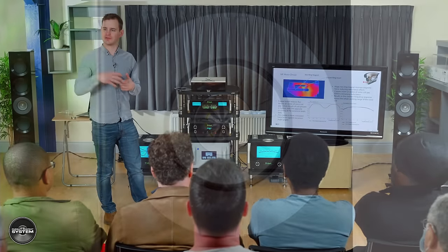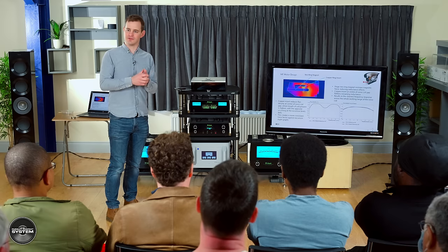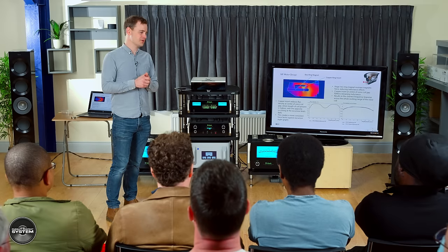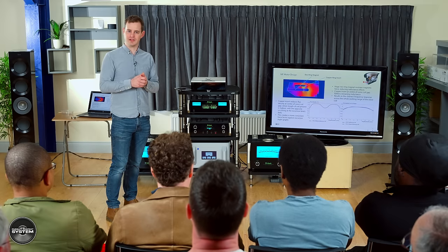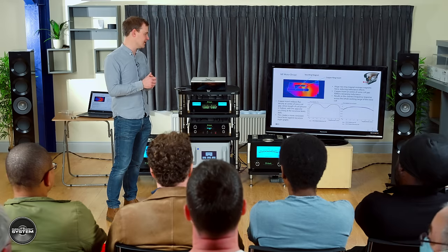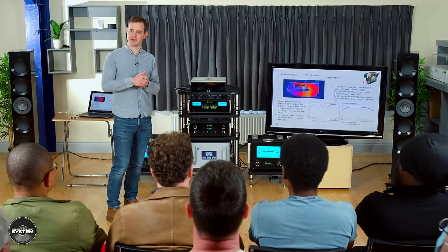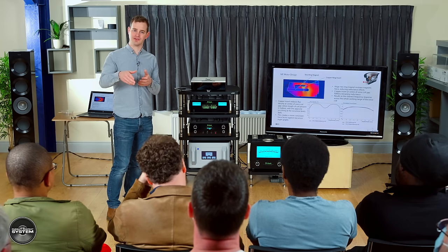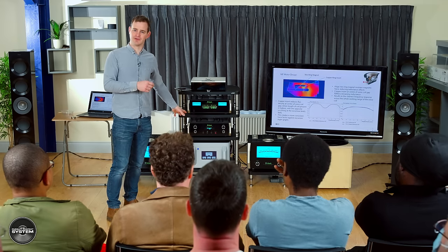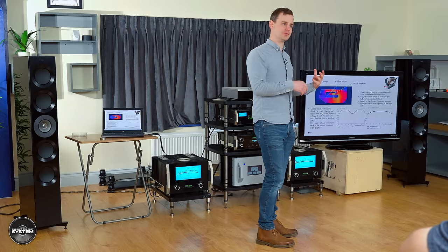The motor system is absolutely critical. That's the bit that changes the electrical signal from the amplifier into the force that drives the cone. And that's probably the major part where you can introduce distortion of some kind. And so it defines the fidelity to quite a high degree. It's how pure can you make that transfer? Can you get the force applied to the coil to be very, very close to the voltage that's coming out of the amplifier? One of the things we can do to improve that is to make things more powerful.